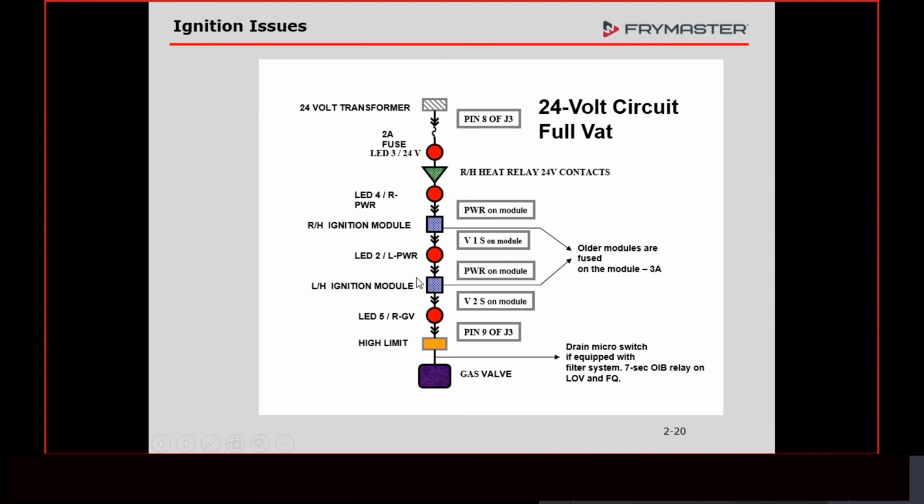So that scenario would be you come in, all right, you know that the fryer is locking out. It's going into ignition failure, or heat failure. You come in, you look in those sight glasses, and you see that we do have a flame. Right away, you're saying, okay, we got a flame, but for whatever reason, we're not sending a good enough signal back to that module, or the module's not processing it correctly, all right? So I need to check our microamps.